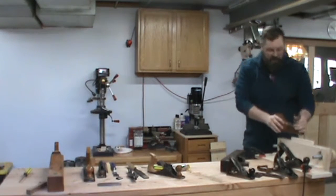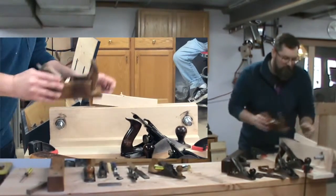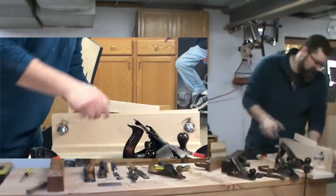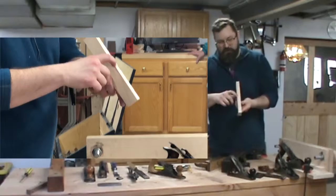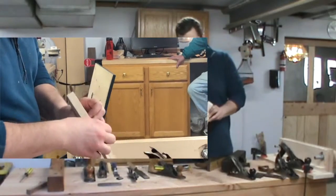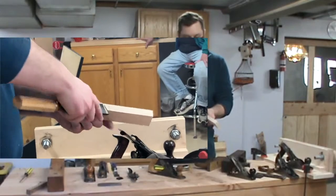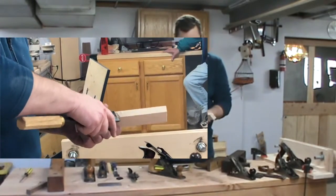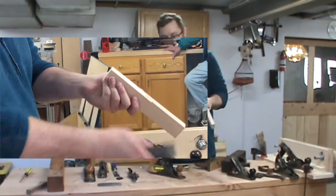I'm just going to put my hand on the back. As I've gone through this one, it's pretty easy to see that I've just made some big chips in this wood. Effectively, the iron has gone in there and wedged this up and split it out — and that's what tear out is. The way to combat that is to plane in the correct direction.